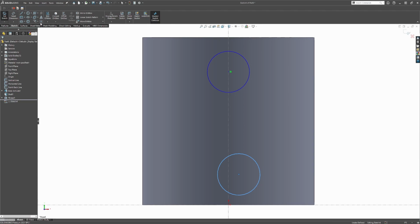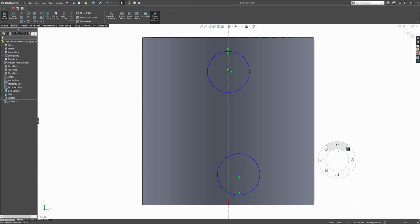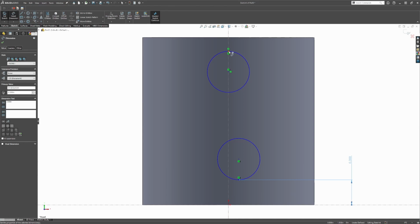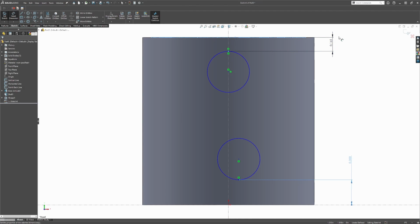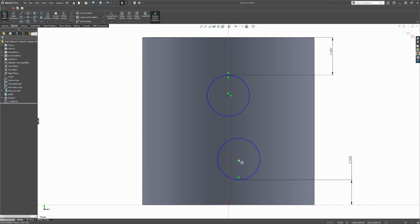And I'm going to put a dot right here so I can measure it later. Right? And we're going to smart dimension this. Our thickness is 0.1 inch, so I'm going to add 0.1 plus, and I want it maybe 0.2 inches away from the thickness. Same thing goes for this one. I know that my threads is 0.25, and then I'm going to put 0.2 away from that also. Great. And I'm going to move this over slightly where I'm going to align these 2 pieces.